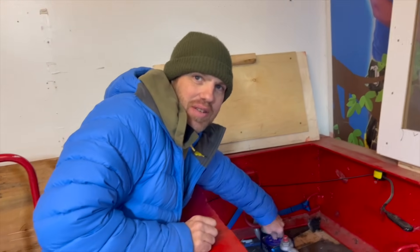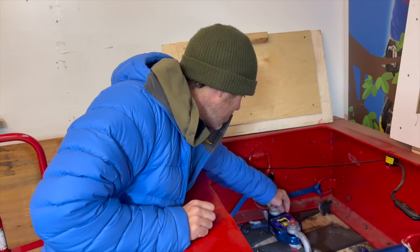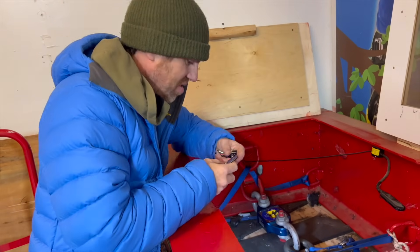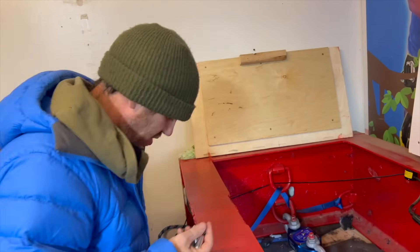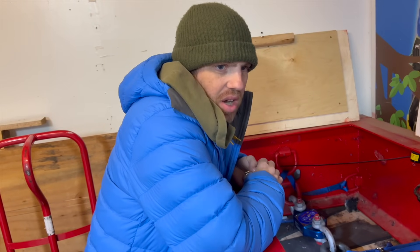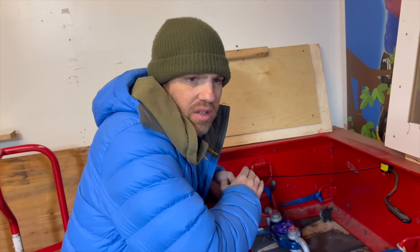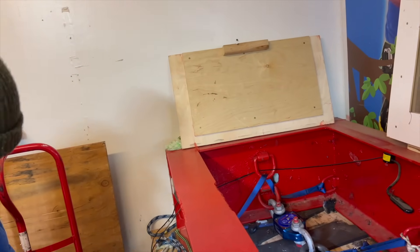So PLA is the winner. It gets a bad rap because it's the cheapest a lot of times. People always want the thing that's more expensive, but sometimes the simple answer is the right answer. So it's the cheapest and the strongest — out of these. Once you get up into some high heat filaments you can get stronger, but PLA beats PET-G and carbon fiber today. The matte PLA has some sort of non-reflective particle in it that seems to make it weaker. The regular, plain, basic PLA that's 100% plastic seems to be pretty strong. Well, it won today.